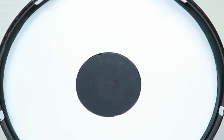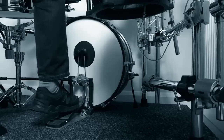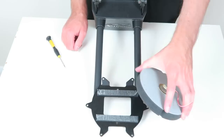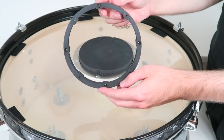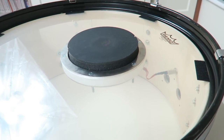Please do not bother with DIY if you do not have the time — my experiment is not cheap. It makes more sense to just buy the KD22A adapter in most cases. This is only something for people who like building things and can improvise. This entire kick drum construction would have been cheaper and easier to build if I had not used the KD9 cloth pad. The cloth piece is just foam attached to a metal disc with a 35mm piezo on the back. Foam companies cut such pieces for a few bucks. The problem is finding the right foam and the material to protect the foam surface. Also, the expensive and complicated wooden ring is not necessary if you have a custom foam at a different size. I could have used a speaker ring from Amazon which costs only €6, and a smaller disc at the back without a hole. Cutting the hole into the disc makes the part very expensive. The piezo could have been attached to the back — so you can learn from my mistakes and build such a kick drum for less than €100.